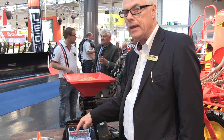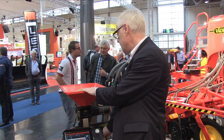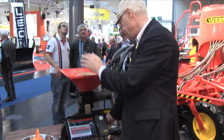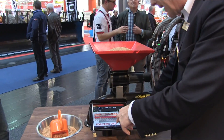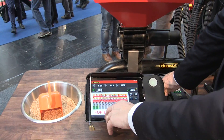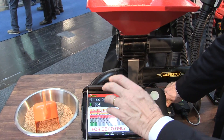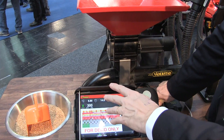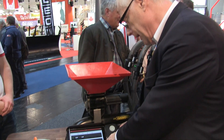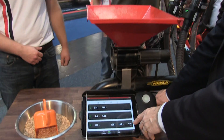There's a very nice graphic here that shows if it's drilling or not drilling. Here we have around 100,000 grains of wheat — very normal wheat. This system doesn't require any special sorted or graded seed whatsoever. We start to run it. The fan revs up to around 3,200 RPM. This red turned green. Normally the complete field display is green. If there's a problem, it will blink red — for example, a problem in row number 4. Then the farmer can look after the problem. Here we can see the seeds rolling.